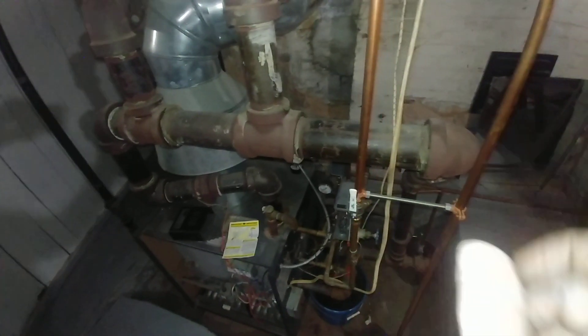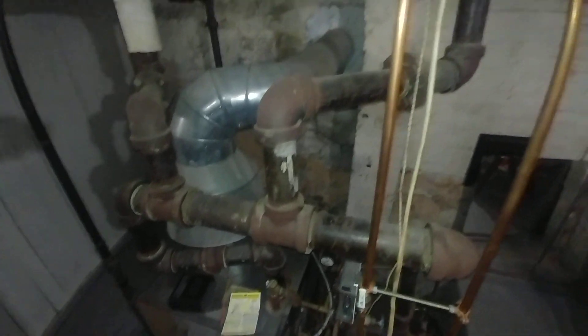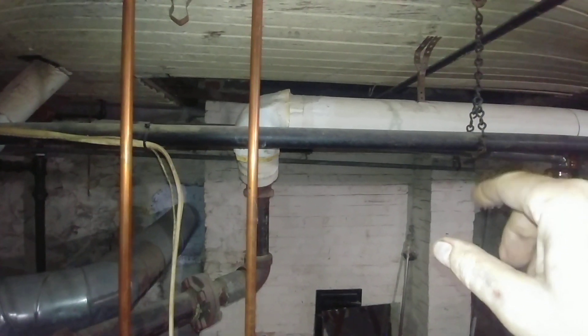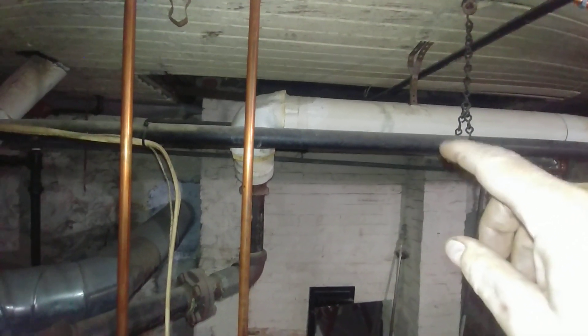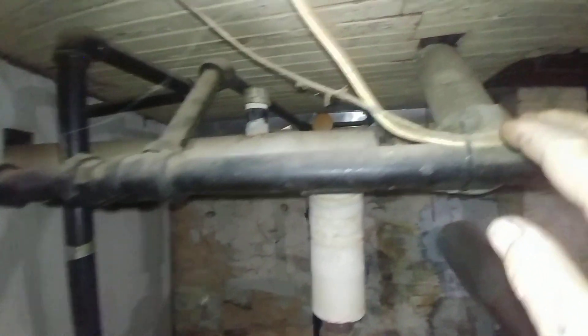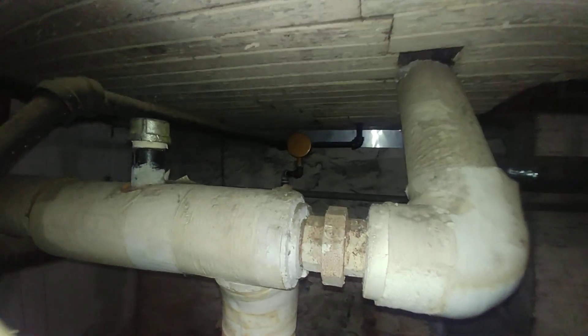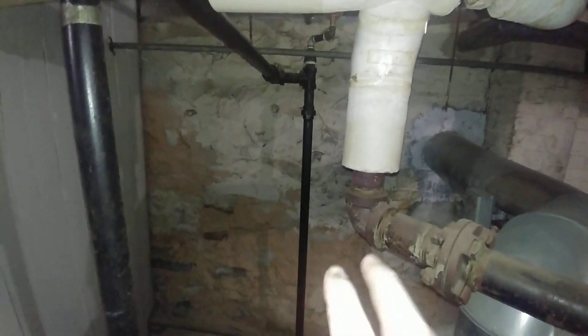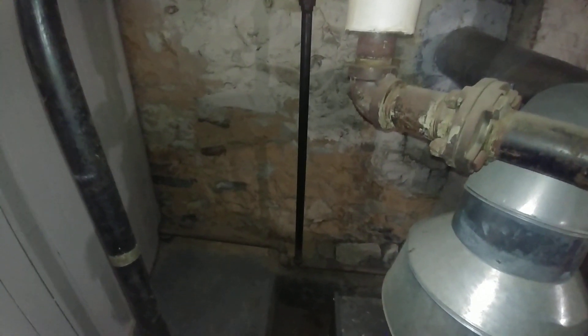It's installed on a reasonable header and this is a two-pipe system. It's an older 1920s Hoffman-style system with Hoffman number sevens and Hanes valves on there. There's the steam main going this way and the steam main going this way, and the dry return. There's a Gorton that we added on the end of the dry return. Any return traps for the old coal system are long since gone if they were ever here.